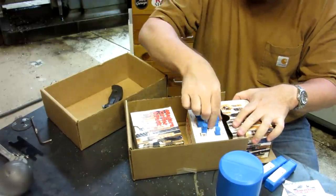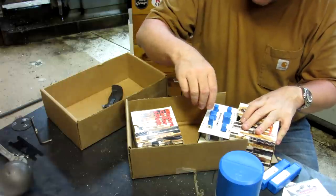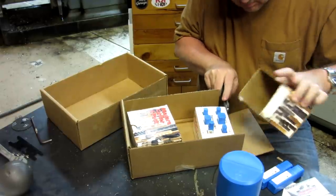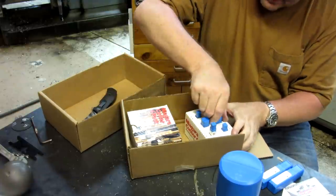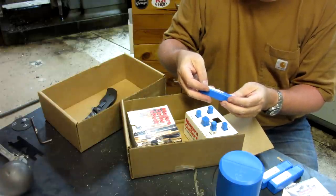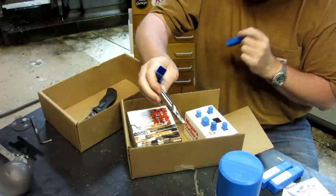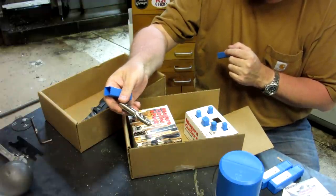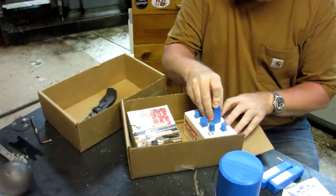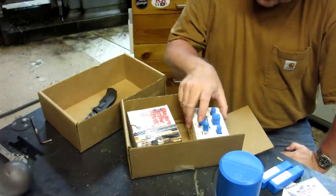Nice. So little cutter sets here. 5/16, 1/4 inch through 5/8 of an inch. Now, these are all real good sizes, and that feels good. 2 flute, right hand square. There you go. Certainly a nice size. 5/8 is a real good working size. Big enough to where you're not really scared about taking a cut, but small enough not to really bog your machine down. So very nice.